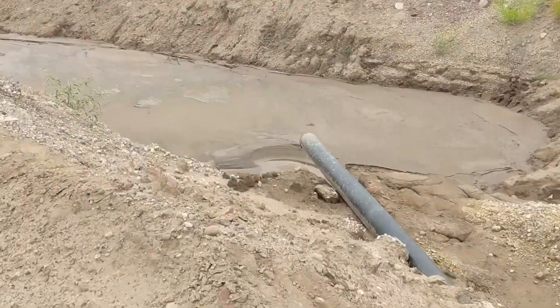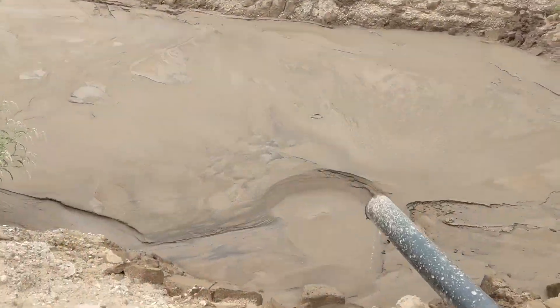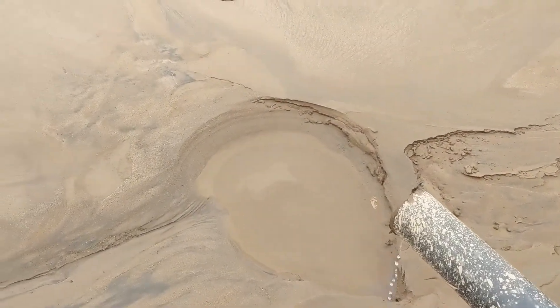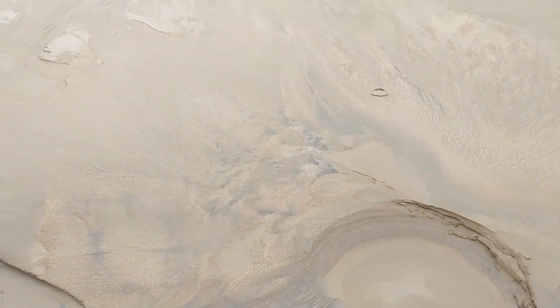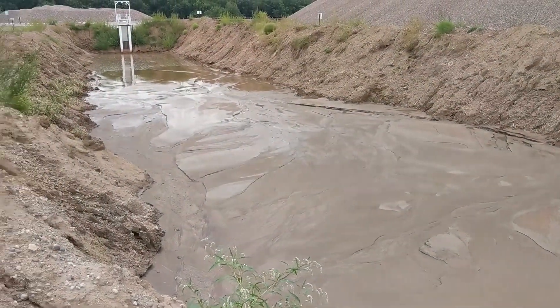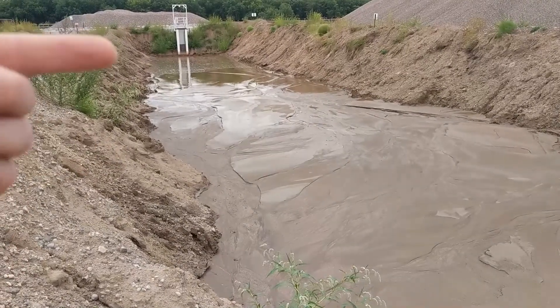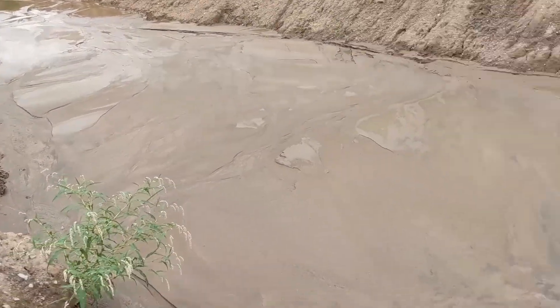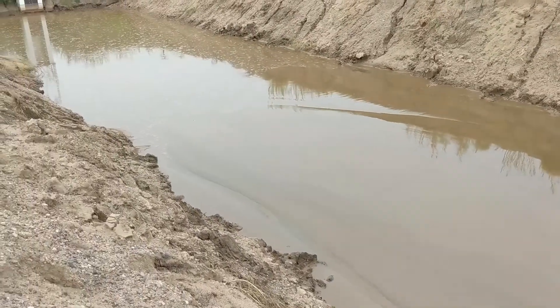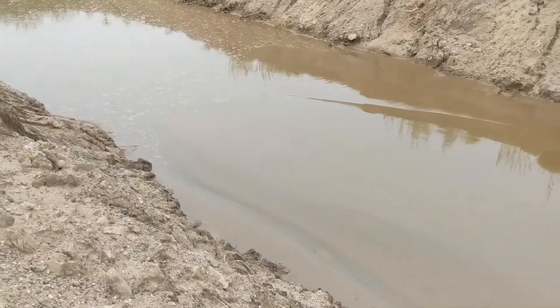This customer is purposely running this pretty thin to allow the material to flow all the way. They've talked about adding different discharge points so they can run it much thicker. You want to maximize your mud volume storage because you're allowing for more time for the sludge to further dewater.